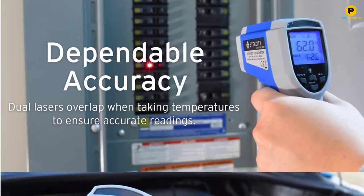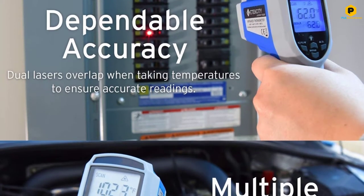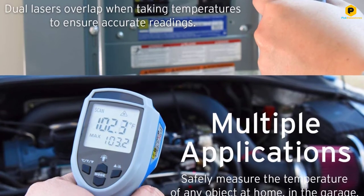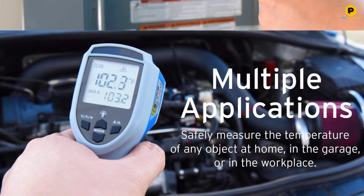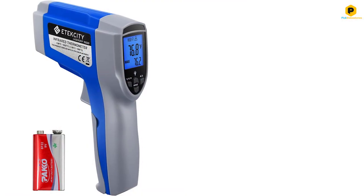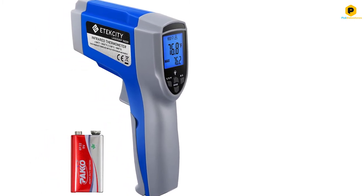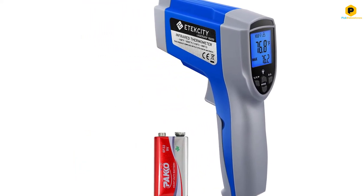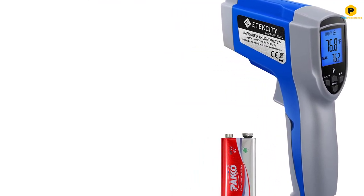The Etekcity 1022D features adjustable emissivity to allow for different surface types. Emissivity is the ability for a surface to emit thermal radiation. By knowing a surface's emissivity rating and adjusting the settings accordingly on the IR thermometer, you will acquire a far more accurate reading. A backlit LCD display on the Etekcity 1022D digital infrared thermometer means you can take it with you into dark spaces without the need to carry an additional torch or light source. The thermometer gun also has an automatic data hold function, which allows you time to record your numbers after you have taken your measurement.